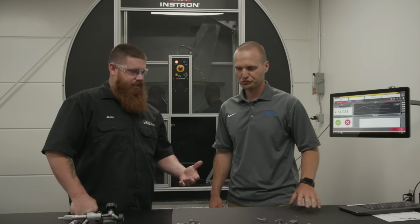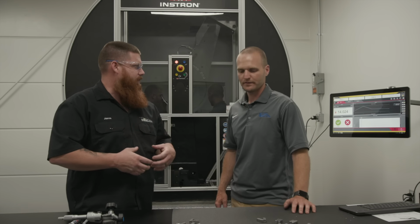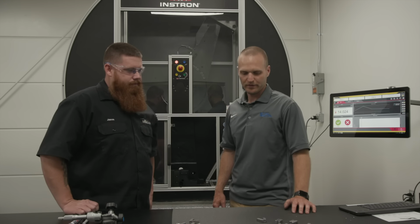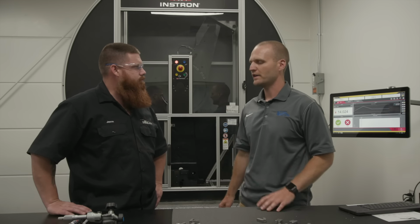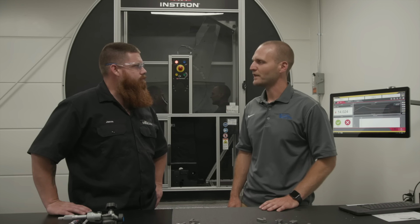So like you were saying earlier, it gives you a much more complex grain structure with that additional heat input versus running the stringers and letting them cool in between passes. Yeah, when you have a high heat input and you don't split your beads, basically you have these large columnar grains and you have a lot of grain boundary ferrite, probably have some other stuff going on as well. Recipe for disaster in Charpy testing for sure.